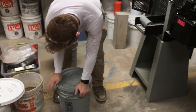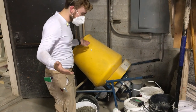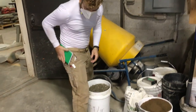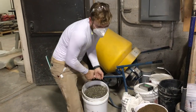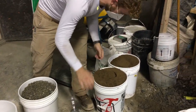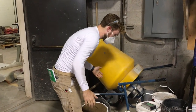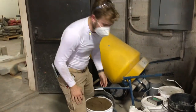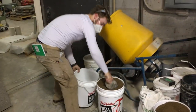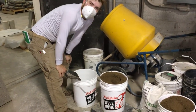There's other materials like this. Heavy duty scale — a bucket is 60 pounds. That's what I'm looking for: 60 pounds of coarse aggregate. I'm going to guess this will weigh more because the sand compacts. So this is 67 — pretty much roughly the same. We can take some out just to get 60 of each. This should give me about a cubic foot.